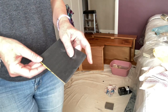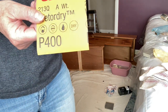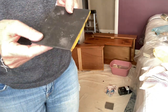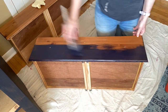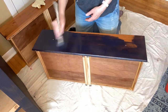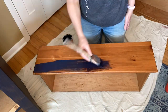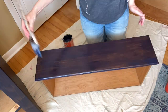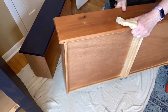After using the 60 grit block I took a 400 grit to go over the drawers before cleaning them off with tack cloth and starting to paint. The tack cloth is kind of a waxy feeling cloth — it picks up all the lint and the dust. It is one of my favorite tools. You gotta have one.